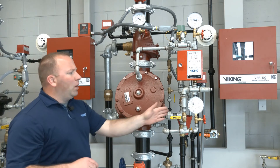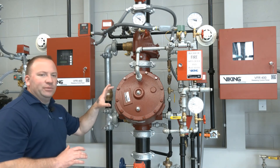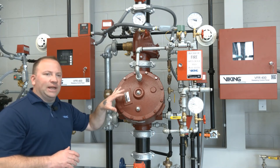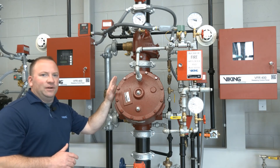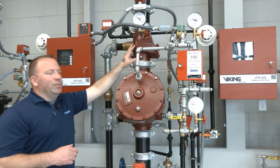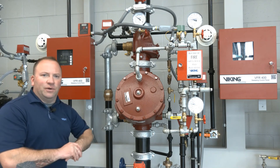The opposite of that would be having water trickle out of the ball drip on the right hand side, which would tell me that maybe the valve isn't fully seated closed — a small piece of debris under the valve where it meets the seat would allow water pressure to come through. Understanding how the system works and looking at the outlet chamber ball drip: if I have water it's a matter of perhaps flushing a piece of debris out, and if it's air pressure it might also be a matter of flushing debris out. If the problem is deeper than that, we have rubber replacements for both the easy riser check valve and the Model F deluge valve. Knowing what's going on and how the system is laid out can really help steer you in the right direction for a potential repair.